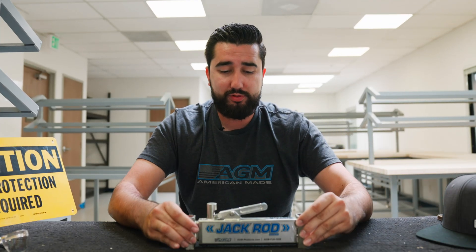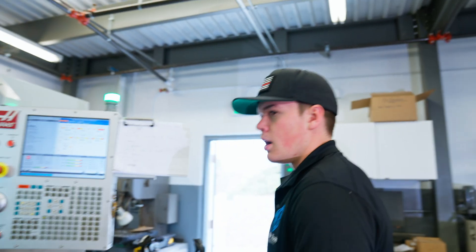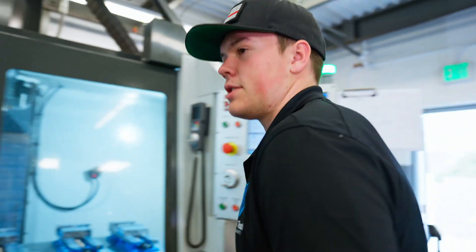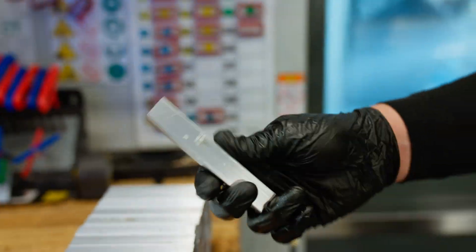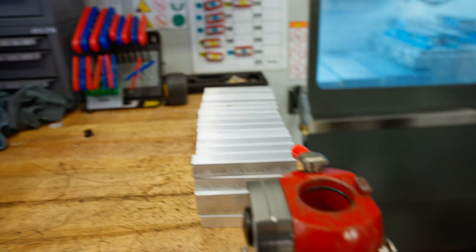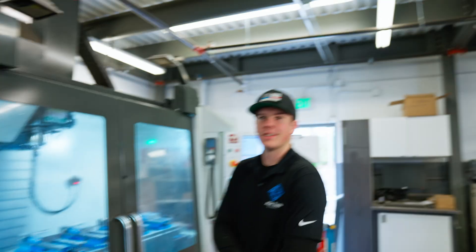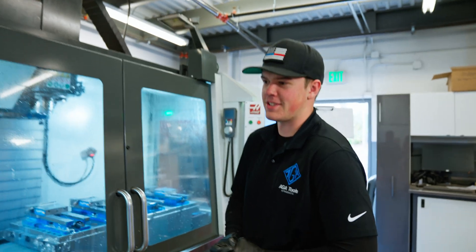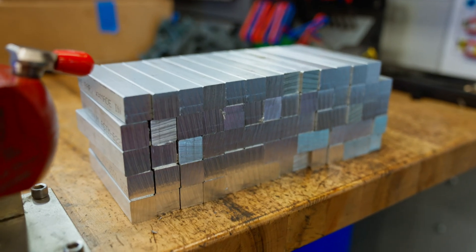This handle is machined from a small block of aluminum, but I'm going to let Cooper tell you how we do that. Where do we start this process? So we start this process over on the band saw. We cut these into four-and-a-half-inch pieces from raw stock, and then each one will have its own size piece. Do you cut all these? I do — I also cut it all. It's about six days of work or so. All right, so that's how it starts. Look at that. Gorgeous.